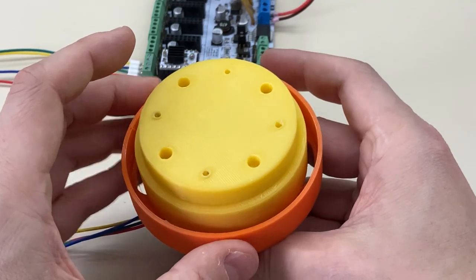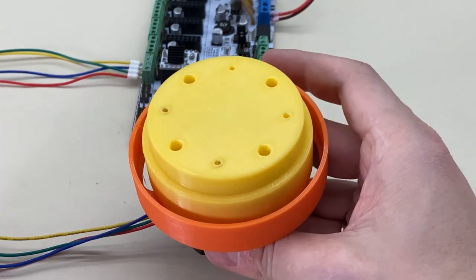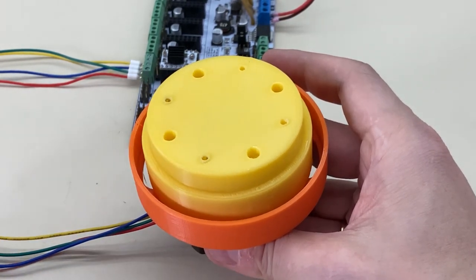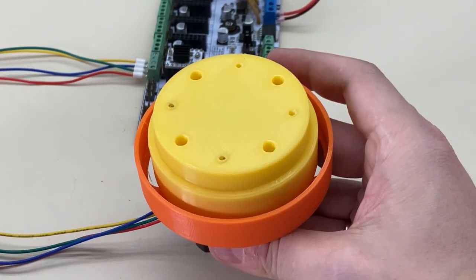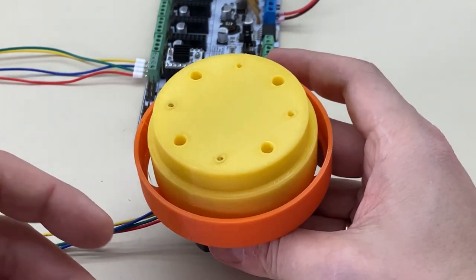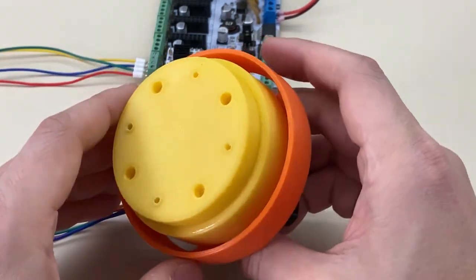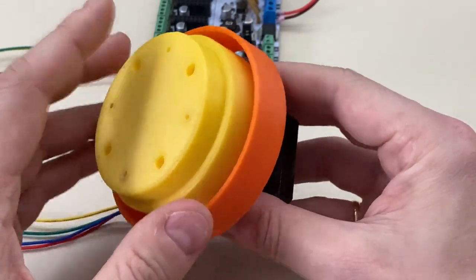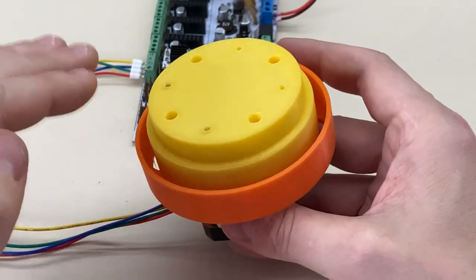Something I would love to do is have a way to send a wire right through here and out the other end, so I can chain one motor onto the next and they can be completely separated from each other. The beauty of that is if I need to replace the fourth joint in my robot, I take the fourth joint out, put the fourth joint back in, connect the third and the fifth to the fourth and away we go. I don't have to take the top three joints apart in order to get at the fourth and then reverse — so much easier for maintenance. Another advantage is that if I can have all the gearboxes the same, the total number of unique parts comes way down.